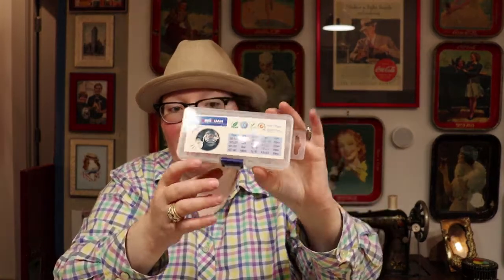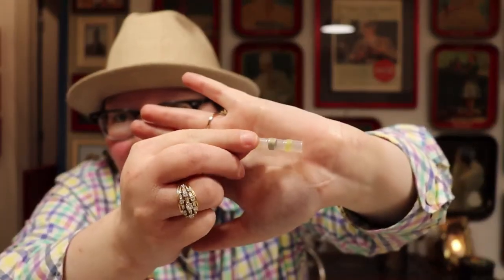You're also going to need an on/off switch. In my last video I said to get one pre-fabbed on the cord, but I couldn't get one with the pandemic, so I'll show you how to put one on — they're very easy. You'll also need some toothpicks so you can apply glue and secure the socket inside the camera. You're going to need heat shrink wire wrap — they have a metal band on the inside and tubing with glue on the inside, and that is how you connect your wires. You need a lighter to activate the heat shrink so the glue melts and connects the wires together.